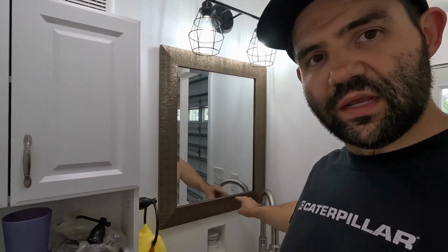So everything that I did was in the plans, inspected by the inspectors, done correctly, and I believe in the long run it will be better as a result, because I have 36-inch frost footing underneath everywhere there's plumbing. All of my plumbing lines are 36 inches deep or deeper. All of my venting, my intake vents, and all of that stuff is up to code and meets regulations. If you're going to do it right, you might as well go all the way and get it approved also. Different strokes for different folks, and that's fine. This is how I did it.